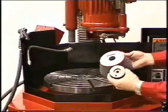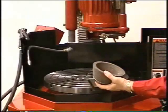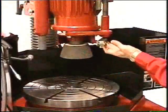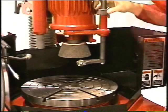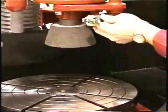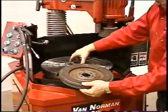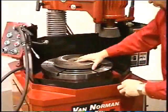Operating your machine. Install the grinding wheel using the grinding wheel mounting flange inside the wheel and the appropriate spacer if required. Be sure to select the proper length bolt and line up the dowel pin to the hole in the motor armature. Dress the wheel: drop the dressing arm down from its rest and adjust the star wheel so they just make contact with the grinding wheel. Move the star wheels back and forth across the wheel, advancing the collar on the dresser to dress deeply or shallow. Mount the flywheel by first placing the correct flange adapter onto the table. The adapter must make full contact with the crankshaft mounting surface of the flywheel. Place the flywheel onto the flange adapter and use the correct size centering cone and bolt to secure the flywheel in place.